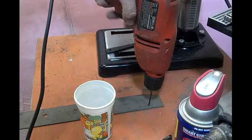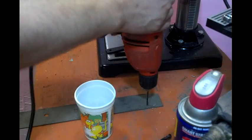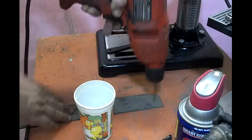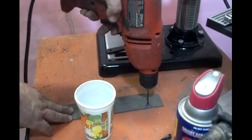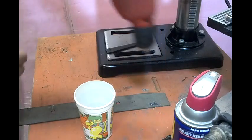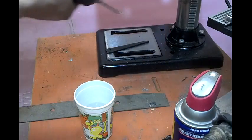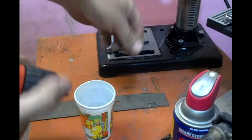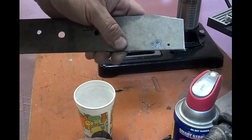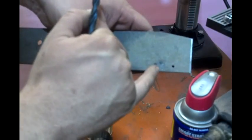I do not need to buy anything fancy. Let's dip this thing — make sure our drill bit's decently lubricated and wet. Can you see the steam coming off of that? That tells me let's dip it again — that means it's getting hot. Now that we have a pilot hole drilled, this little hole makes a world of difference. It doesn't matter if you're drilling 5/16, quarter inch, or half inch — that pilot hole makes a world of difference.